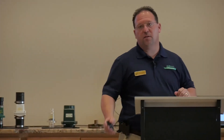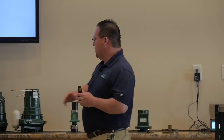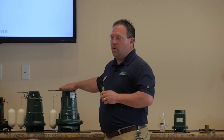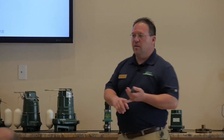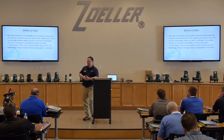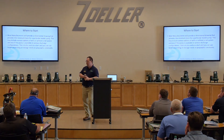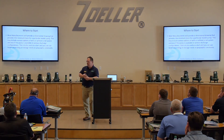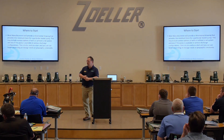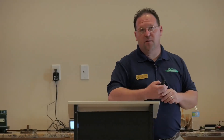We use 24 inches as a reference and a good rule of thumb. In a perfect world, when I was doing installs, what I'd try to do — if the basin was deep enough — was keep the pump completely submerged. If you can keep it completely submerged, you eliminate air and oxygen, so the pump won't rust. It might get black and dirty down there in that enclosed environment, but when you pull it out and hose it off, you can probably still read the tags just fine. You just have to decide if you have enough working volume for a good run time.